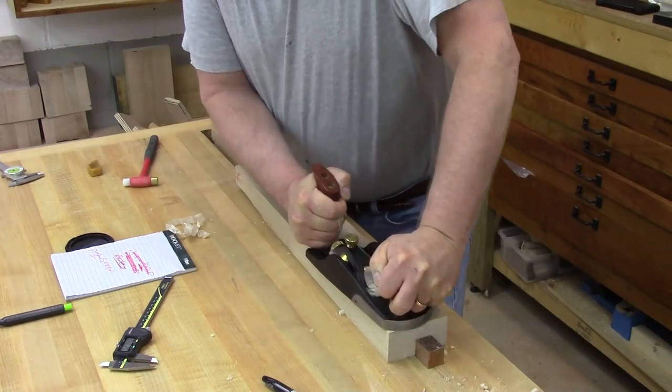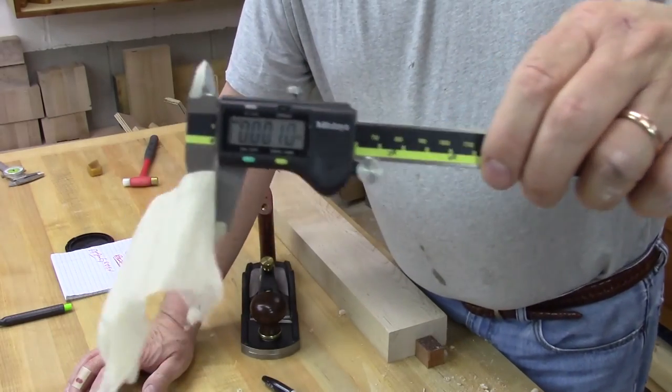This is what the final hone looks like on the wear bevel — it's polished, it's clean, it's ready to use. Well there you have it, we've done all our sharpening. As you can see I think it's working pretty well. I cut myself when I was taking pictures of it; I barely touched the blade and had a nice little slice across my finger — so yeah, it's sharp. I want to make clear that everything in this video was shortened to show you the essence of what I was doing. When cutting that curve I did four strokes on each one. You're going to have to look at the plane and see what it takes. It took me a lot longer to get that primary bevel than I'm showing because I had to cut a lot of metal. The big thing I want to emphasize is just to keep looking at the blade.